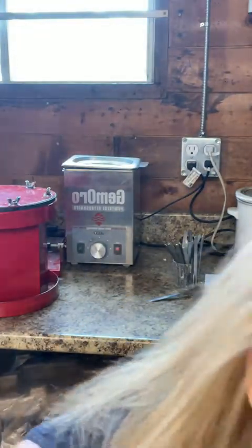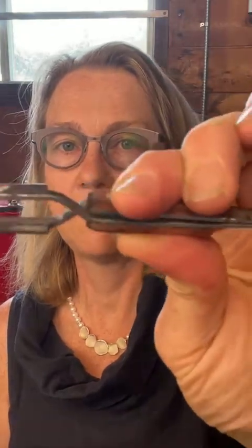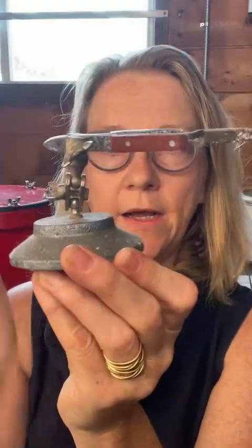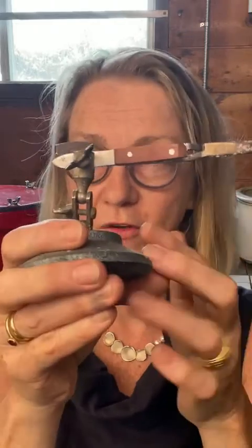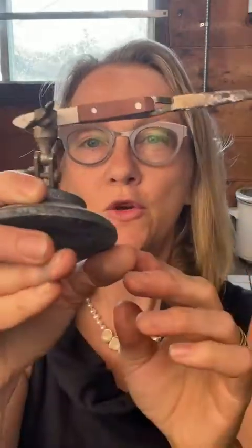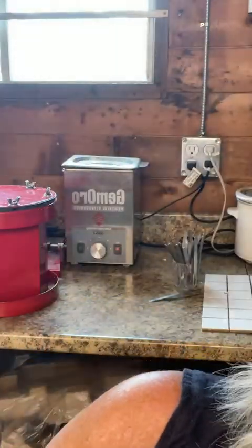And there's actually also what's called, maybe I can find one here. Yep. These are locking tweezers, so they have a spring action, and so they hold, you can see I've heated this a bunch. They hold things securely. It's a tricky thing, you don't want to always do it, but this is called a third arm, because sometimes you need one hand for the torch, and you might need one hand to apply the solder, and then you need sometimes what's called a third arm. This is one of these squeezy ones, to actually hold the piece of jewelry. As any goldsmith out there knows, that gets tricky because this is called a heat sink, so the heat from the flame can go into the metal in here instead of staying in the metal, and that can cause some serious grief.